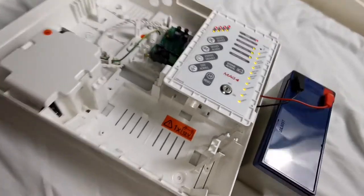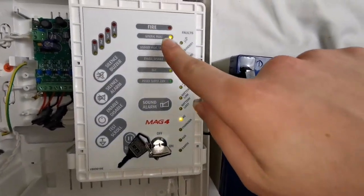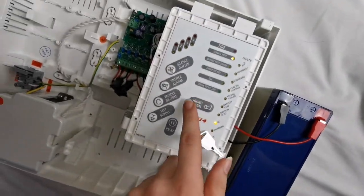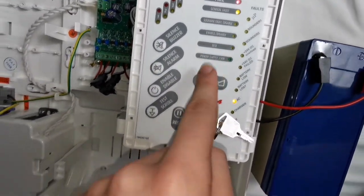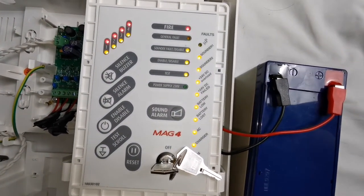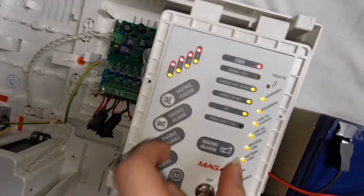You can actually pop this front panel off — being careful — which gives you space to insert your battery. The cables go in just like that to connect your battery up. Just as a quick test we're going to plug the battery in for a short minute to see if the panel works. It does work — inserting the key, it's probably going to show power faults since it's only on battery. General fault, no mains — so it's just running on battery right now. If you go here you can sound the alarm — the alarm's activated — now silence alarm, and we can reset.